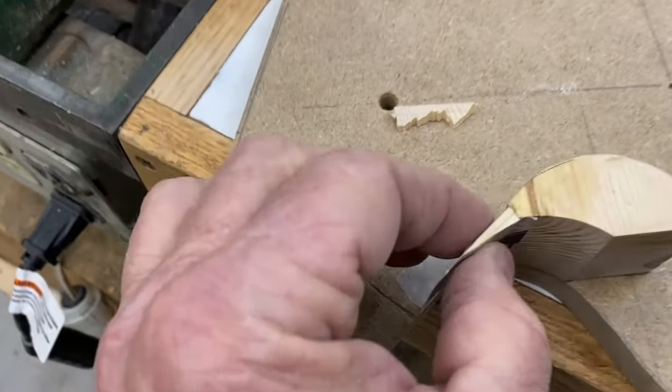I have all these little patches put in. I've got four holes drilled in here that are threaded so that a bolt can run through to adjust this for height. I've got a piece of thin wood that when I run the bolts in will not mar the back of the guitar. Let's put the guitar in here and try it out. Here's the 60-degree beveler in the router — I've got it set to take off the full amount, but I'm going to lower it down and only take off part at a time so it doesn't grab the wood and chip it out. I'll lower this down to where it rides on the jig.